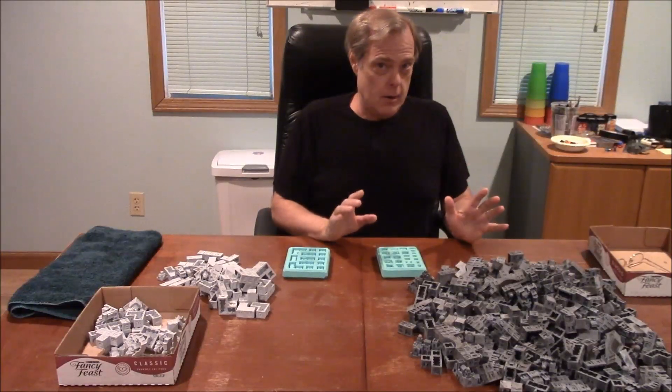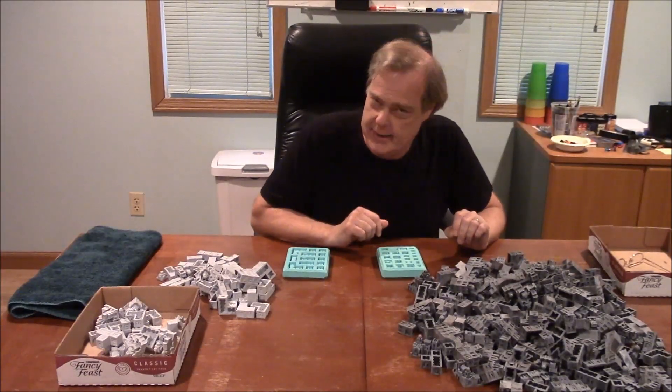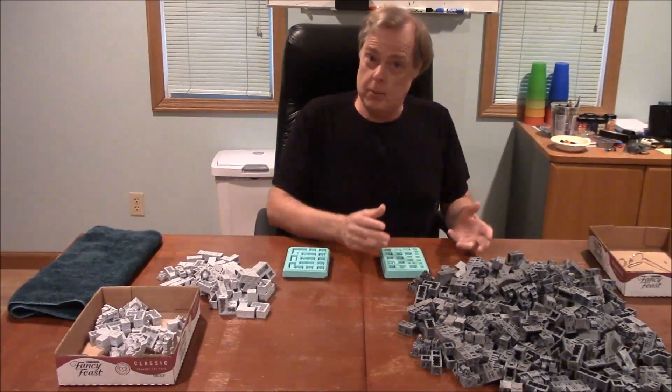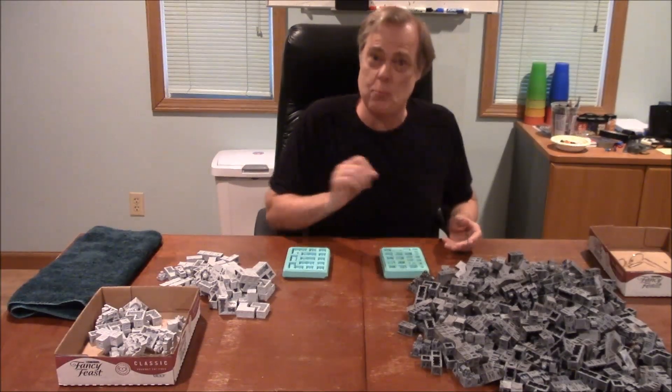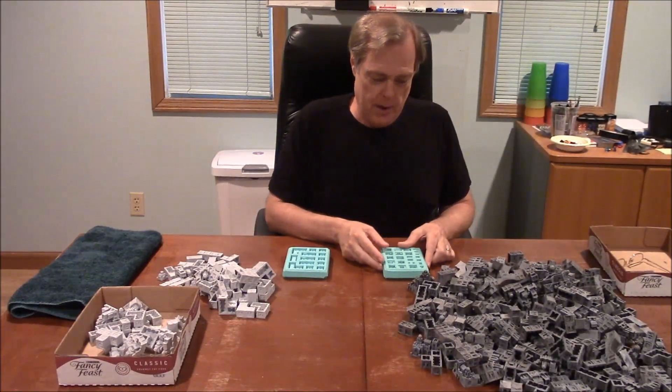The problem with plastic is that you've got three minutes, so you're under the clock. It's going to take one or two castings before you really get the hang of it. Also, if you spill liquid plastic somewhere it's a lot harder to clean up. If it's pre-mixed you wait for it to harden and chip it up; otherwise you wipe it up with a paper towel. Plastic is a little messier and you're in more of a hurry, but you get perfect castings. With dental stone you can take your time, it's not as messy, but you've got to work to get those air bubbles out.